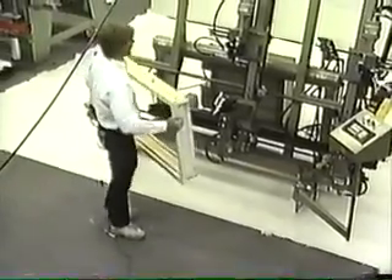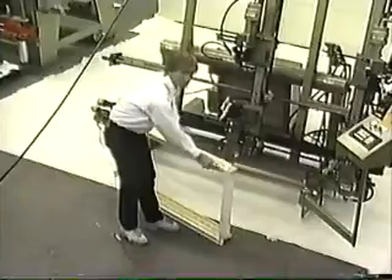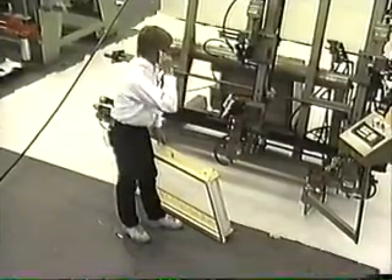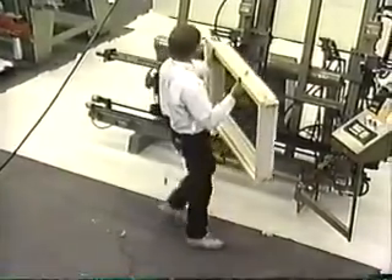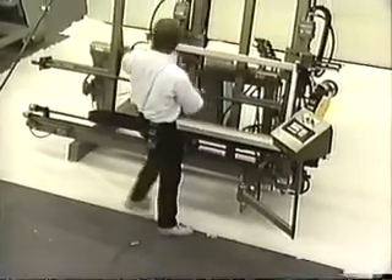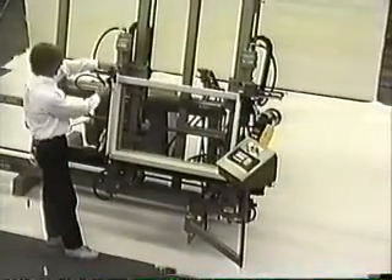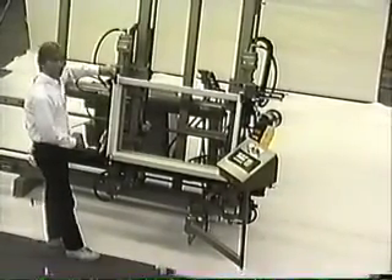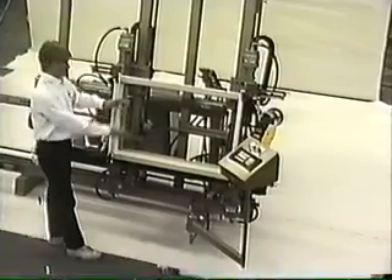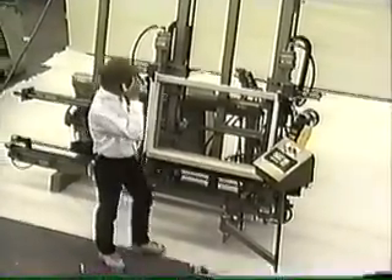It's fairly solid. If you've got brick mold, a lot of people actually take their brick mold and start screwing it into place. There's actually a semi-automatic operation where you could actually come in, clamp but not fire the tool, and actually put a screw in here if you wanted to screw your brick mold together in the four corners. There's plenty of real estate to get that done. We can figure that at the time of the order.